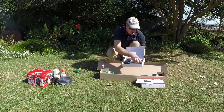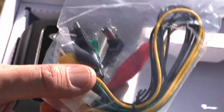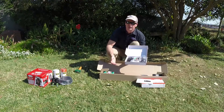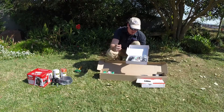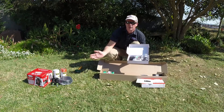The PET-100 unit works from your mains. It does come with additional battery leads so that you can run it off a battery, but the problem with the battery is it will go flat over time and you have to keep recharging it. So you need a recharger, a battery, and the energizer. If you want to run it on battery, rather use the solar unit.